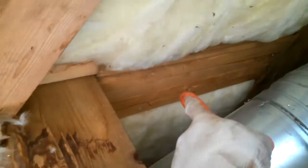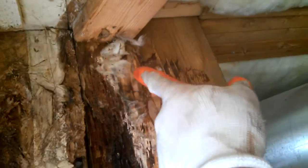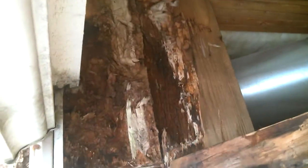That's the header and this header is carrying the weight into that post down there. It carries it down to the fireplace header and kicks it out because there's a significant amount of weight being carried by this. It's carrying this outside wall — all that corner weight is going on that. This should be posted underneath.